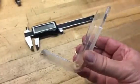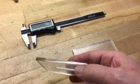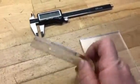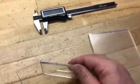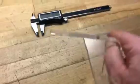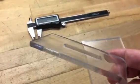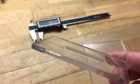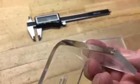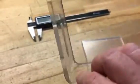And then there's another technique you can use called heat or flame polishing, where you just take my propane torch. You just go over this gently with the flame, and it takes out, you can see it shining there, it takes out the kerf scuff marks from the saw blade and pretty much makes it clearer, polished. It turns out pretty well.